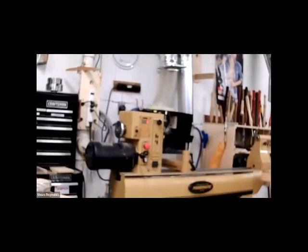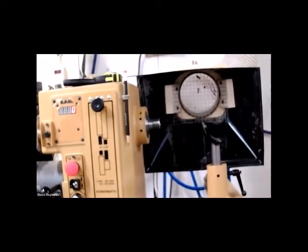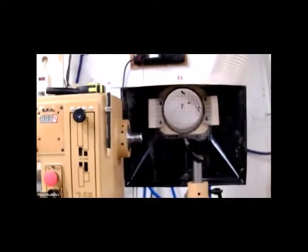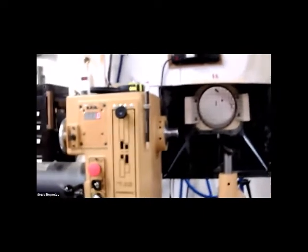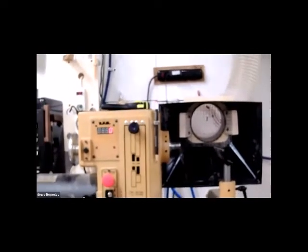It's a terrible way of doing this, but you can see the lathe there. That's got a dust hood in it. It's got one of those big dust hoods that they often have for miter saws. And what I did was to rebuild it for a 6-inch pipe. And with that dust collector running and that 6 inches of draw, you can't get any dust off a spindle or a bowl and into the room because it's just moving air too fast.